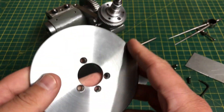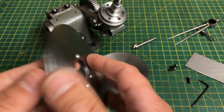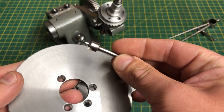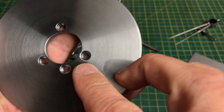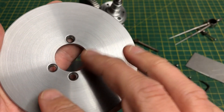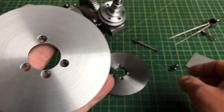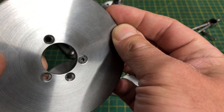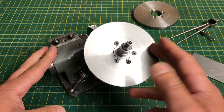Back at the bench, and the three plates are faced, bored, chamfered, drilled, and countersunk. Off camera, I have lightly deburred the back of the holes with a countersink and a battery drill, and I have gone back in on the mill with a wide angle cutter just to take the edge off the top of those counterbores. I hope you can see that even reducing the size of these to quarter inch, they are still very close to that central bore. If I were to do this over, I'd probably increase that PCD by a sixteenth or so, and use the original specification fasteners. Given I won't be doing that, I have gone ahead and turned down the mounting screws to size, and they are a nice fit in the plates. The whole thing fits nicely onto the head, with no perceptible play in the locating faces, and they are ready for drilling.